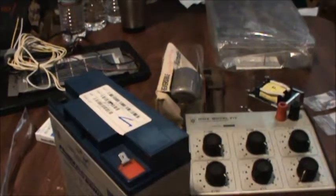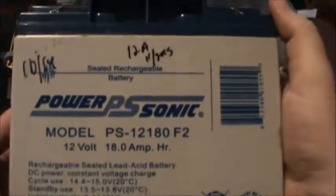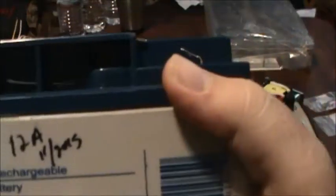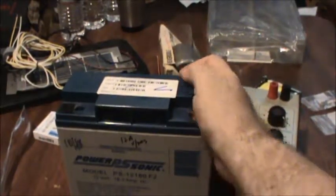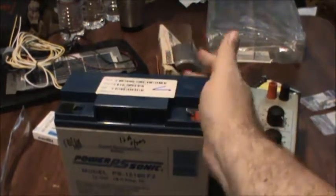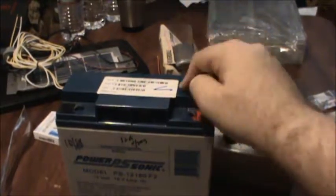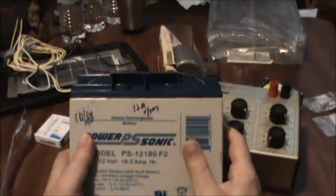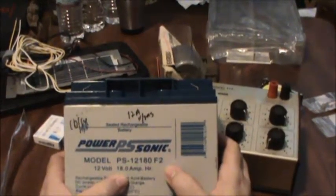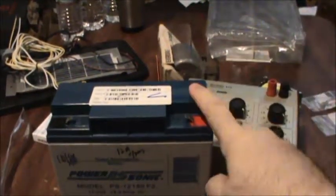The other project I have in mind uses this — it's really heavy, like 10 pounds or so — a 12V 18-amp-hour sealed battery, tested good November 2015. These are only nine dollars each; I also saw them for ten, but I'll save a buck. I got two of them. Thinking about that last video on the ignition coil driver, I'm going to use these instead of those two lantern batteries, because once lantern batteries are dead, you throw them out. Now instead of six volts I have 12 volts and 18 amp hours — a lot more life.